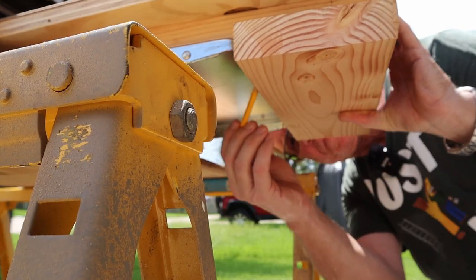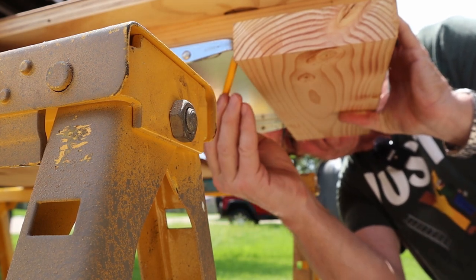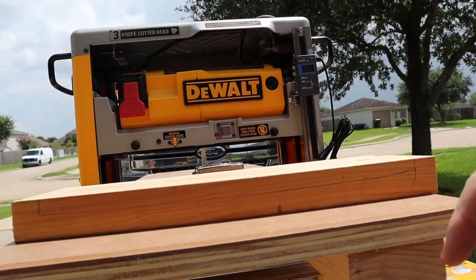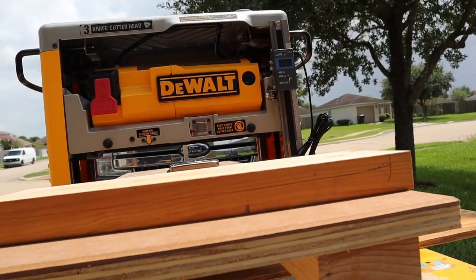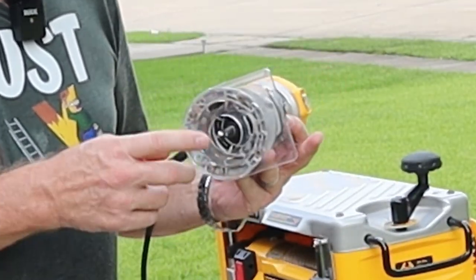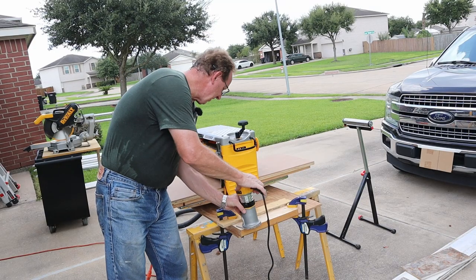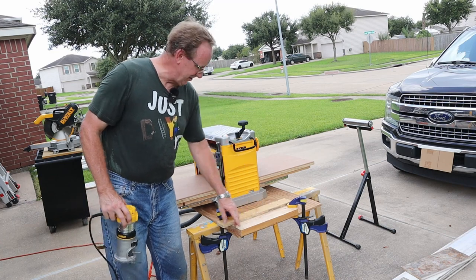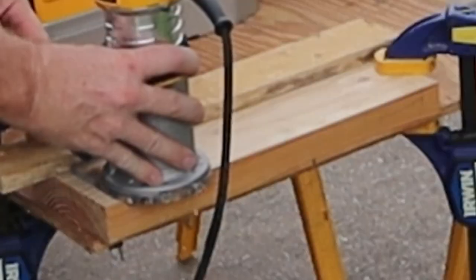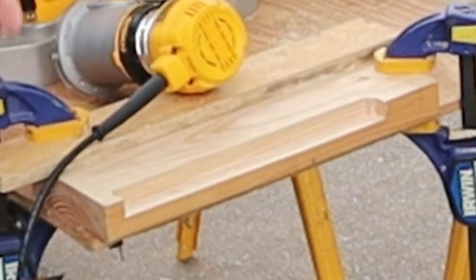That's the groove I've got to cut out. I'll mark off half of this — I'll probably take out a half inch of that and refit it. I'm going to do this with my trim router — I got a slot cutting bit, or groove cutting bit, whatever you want to call it. I've got it set to take out half the distance that I need. I've got a little stop block here so when I hit it, it goes back exactly the distance I need it to. As far as the ends, I'm going to custom handle that and see if I can do it without screwing it up. That worked rather well.